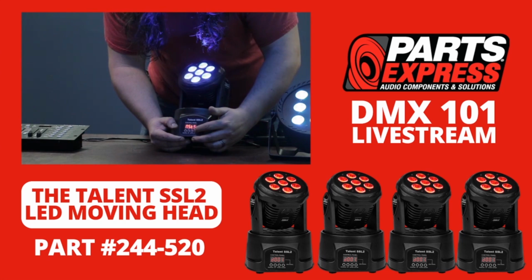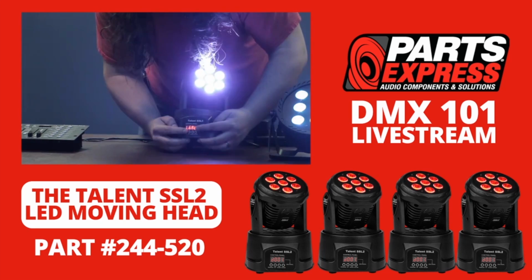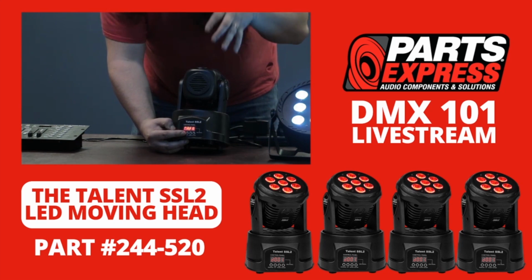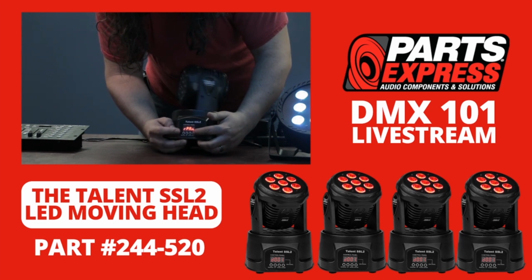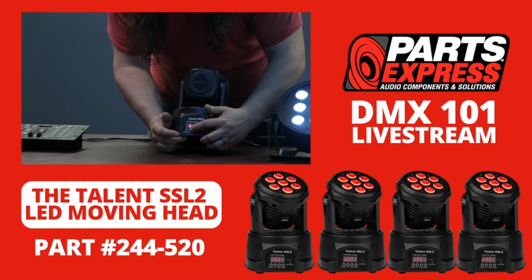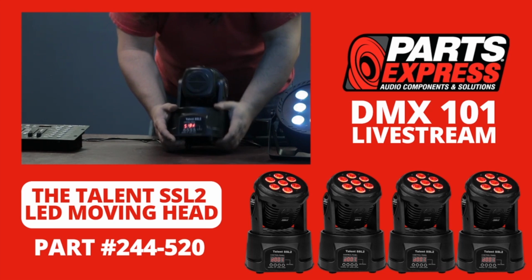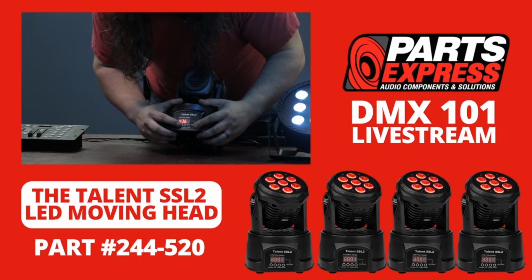I believe this one is right here. I can set it to fast or slow. Now it's in that mode. Let me turn it back to DMX. So that's how I can get to some of the auto modes built into it. I can reverse the pan or tilt on here. I hit pan, and it puts an R in front of it. Now it'll reverse that depending on which way I want it to face. Same thing with the tilt. I can flip the display so that if it's hanging upside down, I can read it. Now I can read it, but you guys can't. Let me change that back.